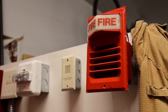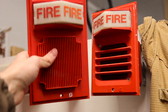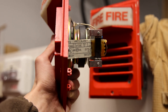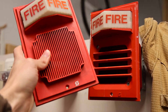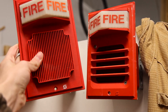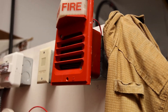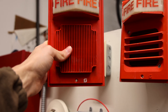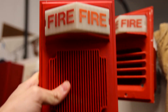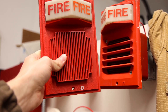As you can see I have a vintage Simplex set up here. I was originally planning on installing this alarm, the Simplex 2902-9739. However, once I started installing it I realized that this cannot be mounted on your traditional double gang back box — it can only be mounted on a special Simplex back box. See, there's only two holes, one at the bottom and one at the top. So after I already wired it up I realized I cannot mount this to the board.